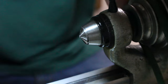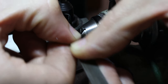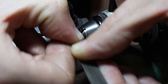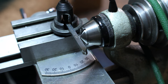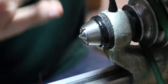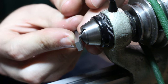Instead of machining these screw head slots, we're going to be filing them by hand. And here I'm using an old screw head slotting file. This is the type of screw head slotting file used by watchmakers traditionally. I'm using this one to start the slot because it has one side ground flat, kind of a safety side. And that's ideal for bracing against a rest like we have here. This might seem like kind of an iffy way to slot your screw heads, but it can actually give you pretty good results.